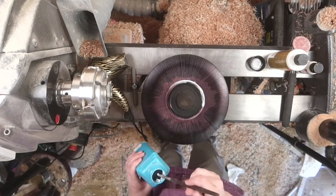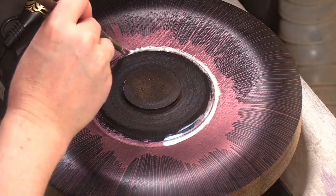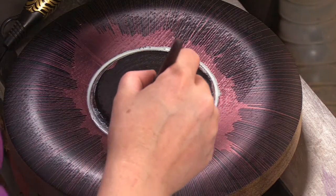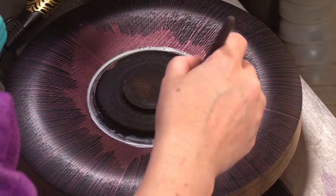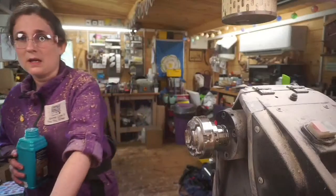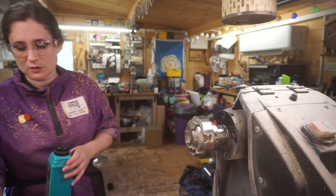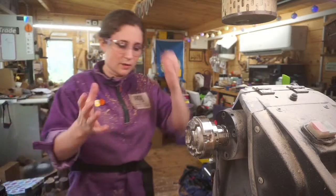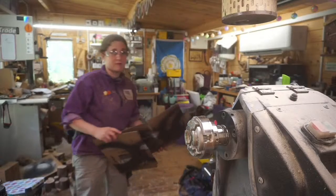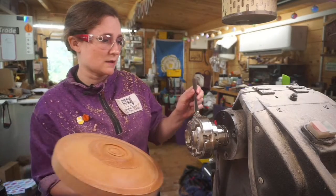I'm just going to go around here. I don't want to put as much of the size on as we had with the paint because we don't want it quite flaring out that same amount. You'll notice that I'm not painting any of this on with it on the lathe, and the reason for that is I have had disasters trying to do that before. If you make your consistency slightly too runny with the Jo Sonja stuff and then you put it on when it's on the lathe, it can run down the platter and that's the platter spoiled. You've got to take it right back through the ebonising lacquer so you can start that again.